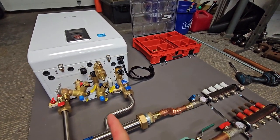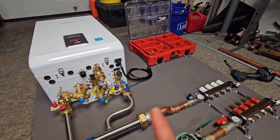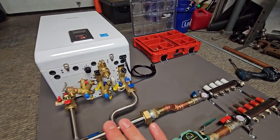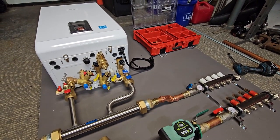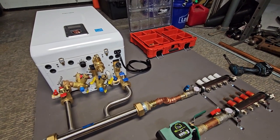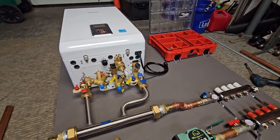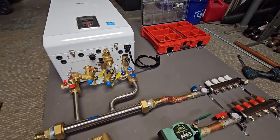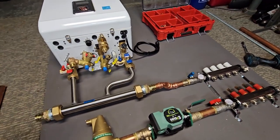These boilers come in many different sizes — the combis range from 60,000 BTUs all the way up to 200,000 BTUs, with larger commercial sizes beyond that. All the time I see people with a 200,000 BTU boiler when their home may only need 60,000 to 100,000 BTUs. They're purchasing something upfront that they'll never fully utilize. Anytime I can help somebody save money and possibly upgrade to something like a more efficient circulator, I'm going to recommend that.